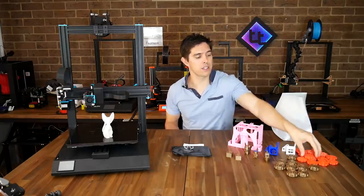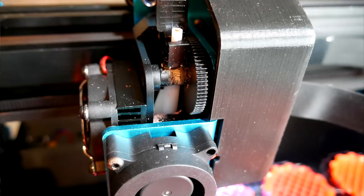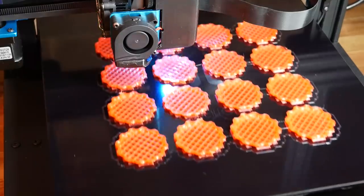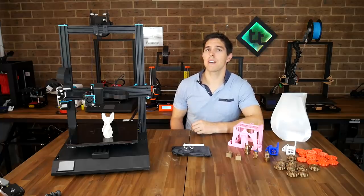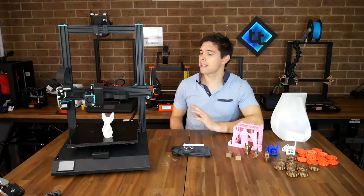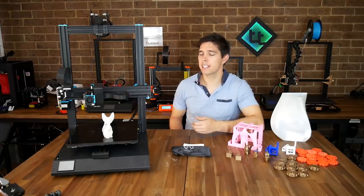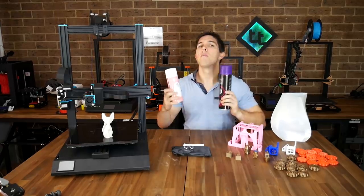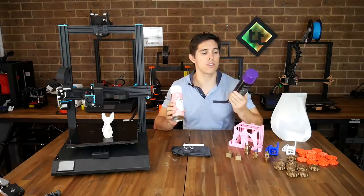Around this time I had some other failures with Maker Coins — not due to the printer but because I tried to use some old dodgy filament. The filament had become soft and the extruder gripped tight enough that occasionally it would grind through and the printer would jam. As soon as I switched back to my quality filament the problems went away. I also had some failures where test prints peeled off the bed mid-print due to lost adhesion — glass can be a fantastic surface but you've got to keep it squeaky clean. I found it much easier to use hairspray, and from that point I didn't have a failed print. My pro tip: use the ones that look and smell like they're from your grandma's house.